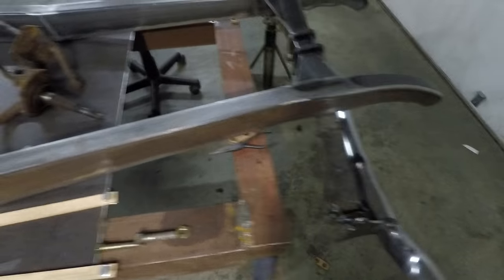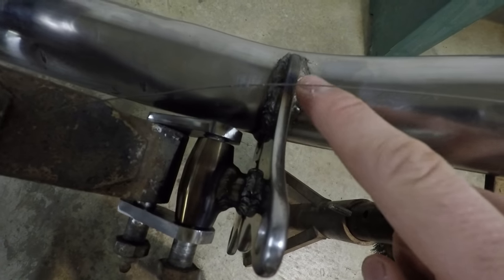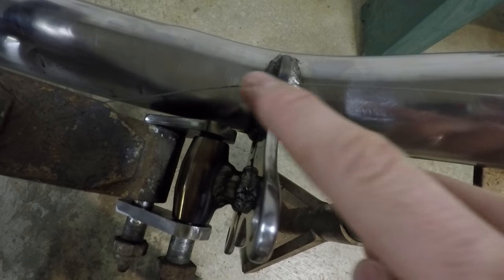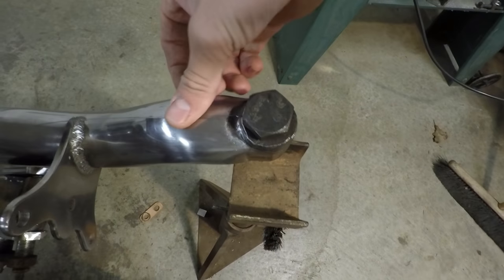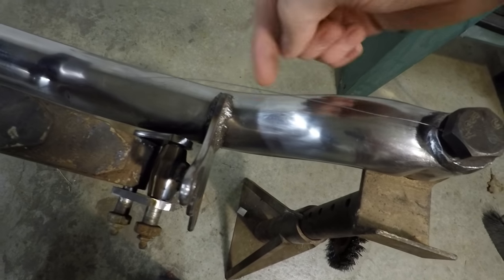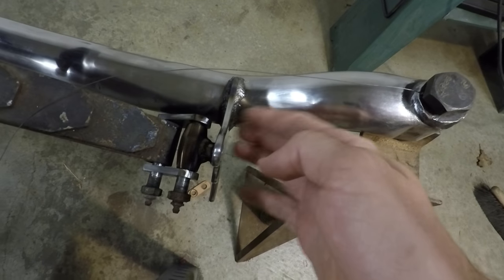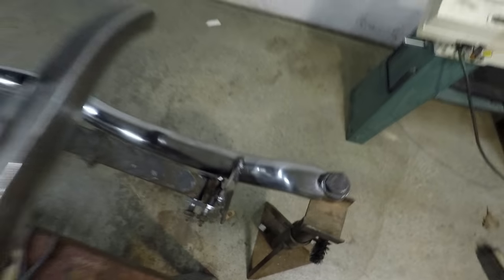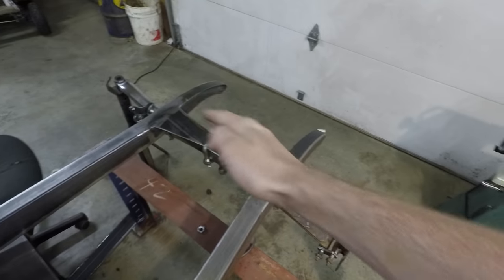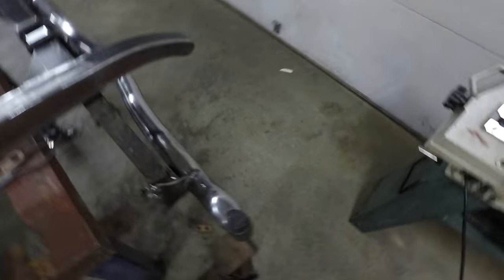What you saw me doing with this bolt with the wire on there is I made some marks on the wire up here. I don't know if you can see them, but they're about a quarter inch apart, and I would put the bolt down here in the kingpin hole and make little marks where I put those marks here so I could measure where to put these bat wings on there relative to each other, and that would make sure that they're both the same distance from either end and that the axle would be centered. And it worked out pretty well.